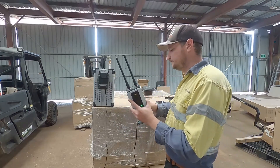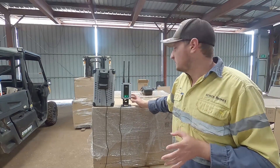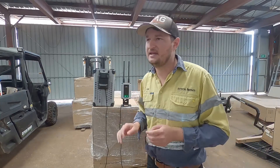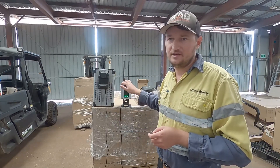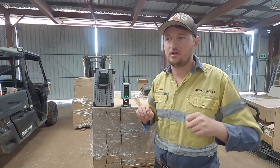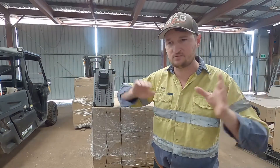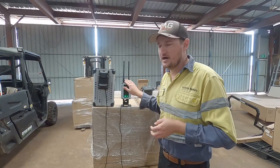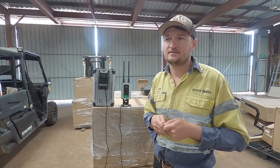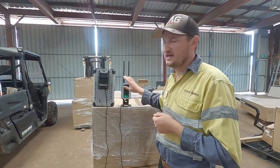Now that's all set up, we'll put it on the stand. It doesn't need to be outside — this doesn't need to have satellite, it doesn't actually pick up any satellites. So you can have it inside. In our setup, we have it in our truck inside and then we have the antennas on the roof. As long as the antennas are positioned well — if you're using this, you might have to put it on the roof to get better signal because that's what your drone talks to. But if you do have the larger antennas fixed on top of your truck or trailer permanently, you can just have the unit inside.